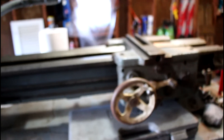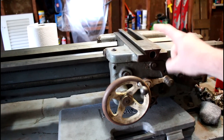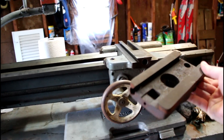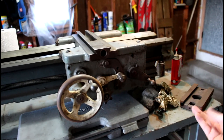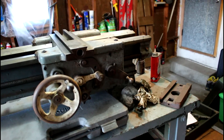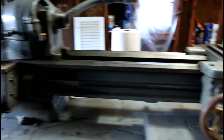That wear goes quite a bit along the bed. Another thing with this guy - the cross slide was off the machine and the guy was like, 'well here, I got it right here.' You probably can't see it too well but it's all rusty and pitted - it's junk. This guy actually cleaned up pretty good, but there's no cross feed screw in here. I got all the outside workings but no screw, and this thing is missing parts all over the place - I'm missing oiler cups pretty much over the entire machine.